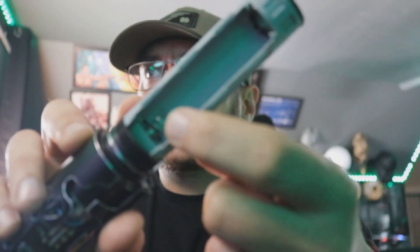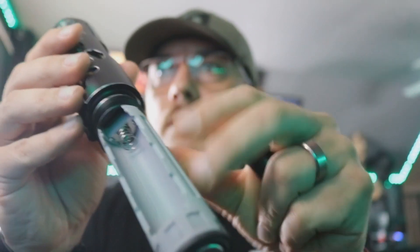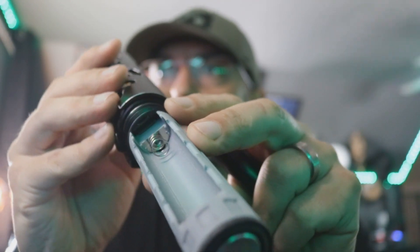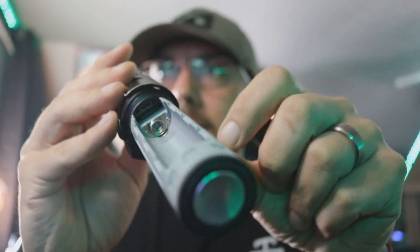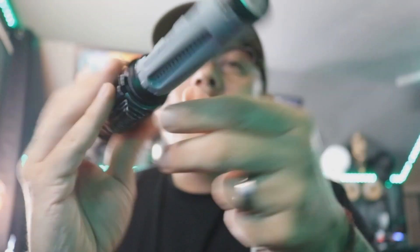So we'll put a battery in. You'll notice the negative side spring here is very low into the battery cradle. I dropped it very low so that I could get that board access, and then I cut it just a little bit — I cut some of the length off that spring. You'll want to kind of make sure that you scoop that spring with the negative side. It's very easy to do — just put the battery in. You will want to make sure it makes contact with the negative side, and if you don't have contact, you'll notice that right away.